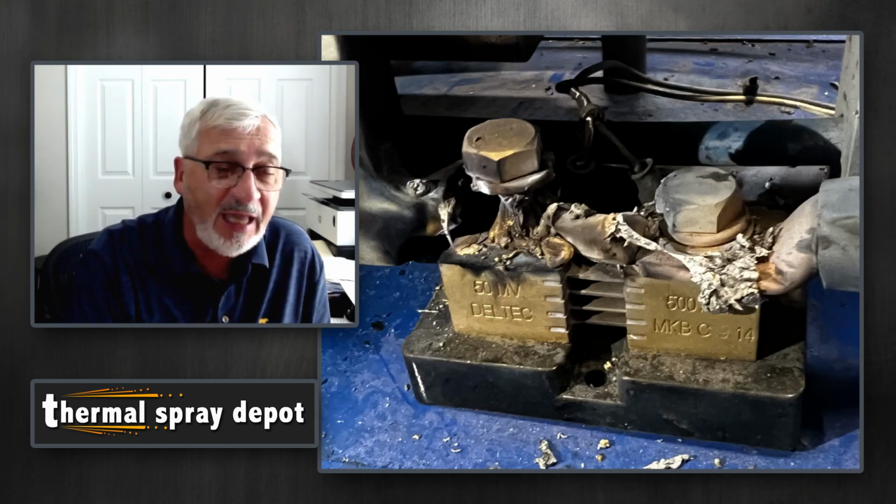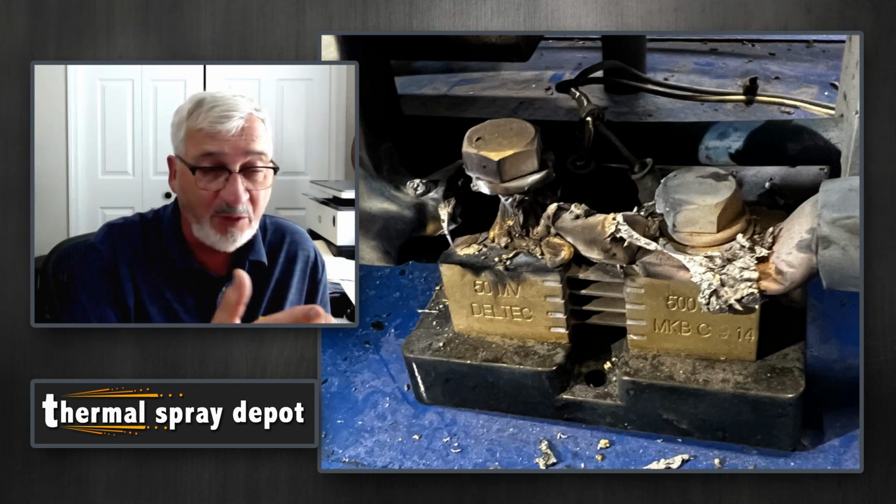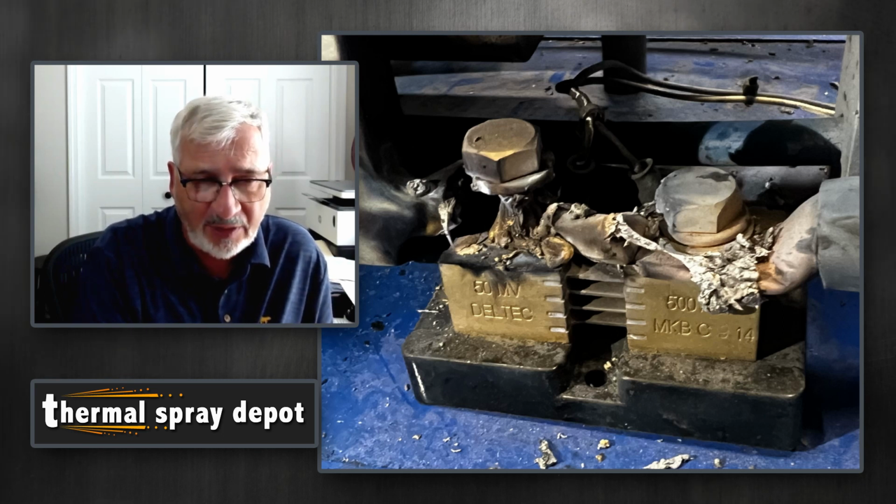I mean, I think you just started on it, but yeah, it looks daunting. Yeah. Listen, in this particular case, this was actually my demo unit. So I demonstrated to myself how critical this is. One of the bolts got loose and it started heating up. What got damaged was the actual two cable ends and the bolt. We were able to salvage this fusible link. We took it apart, cleaned it all up, put new bolts in it, and were able to salvage it and keep running the demo. Eventually, we replaced the whole fusible link, but we used it to get through the demo we were doing.